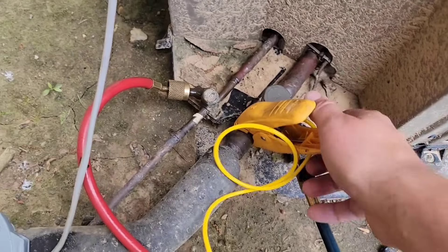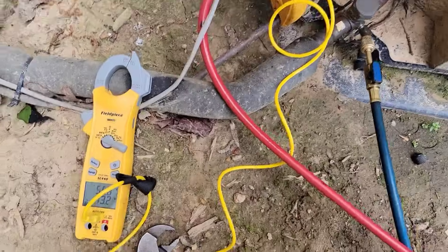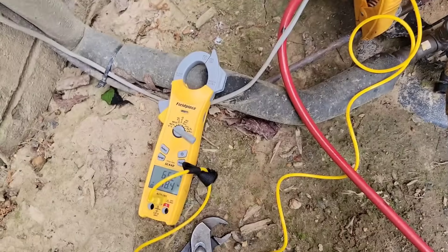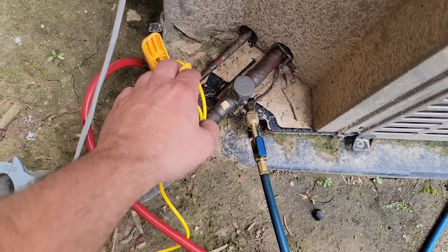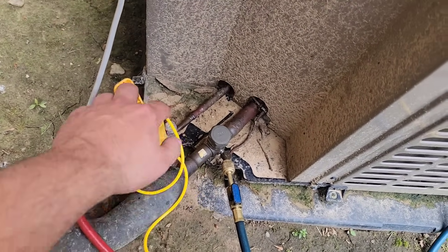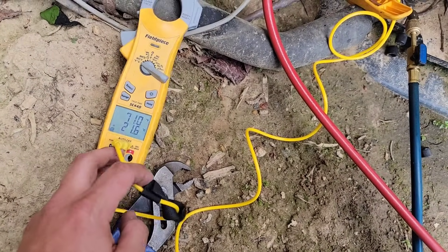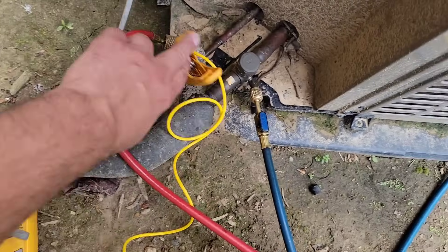51 on the vapor line temp. It's about 75 degrees outside today. Remember, you got this little chart here — need help charging. Checking the sub-cooling, should have around 10 or 11 right now. I'm going to show you something today, something pretty important, something you should be doing on the jobs. We're in the 70s, probably the high 70s — I bet it's about 77.